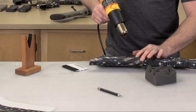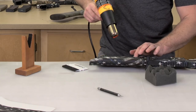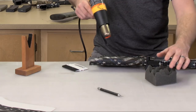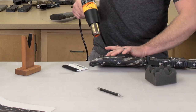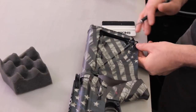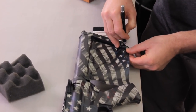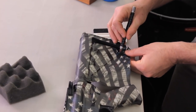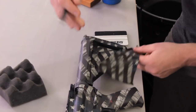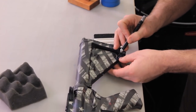Using the heat gun at this point — it's like adding a shotgun blast of heat as opposed to the pinpoint you get with the torch. It spreads the heat more evenly so you can heat the whole area and press on it with the foam to get it where you want it. Now the material's cooled — go ahead and start trimming all these edges and working on the detail work. Angle your blade away from the stock and run it up in there. Take this center piece out the same way.